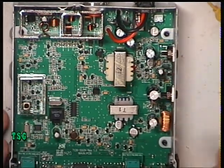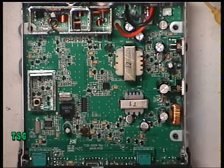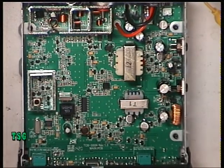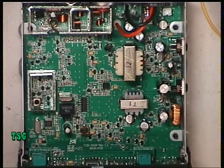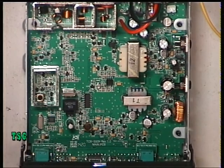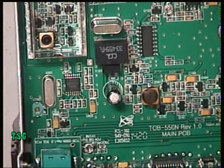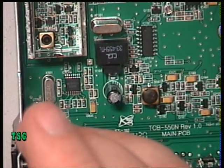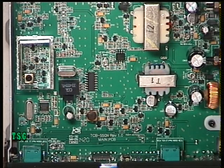There are very few adjustments, so we're going to do this all in one video. Transmit first — I'm going to check the frequency. I'm on channel 20 of the UK band, which should be 27.79125 MHz, and it's reading 27.79116. The trimmer capacitor for the reference crystal — the 10.24 MHz reference crystal trimmer capacitor, labeled CT 301 — is just down there to the left, so I'm going to adjust that.